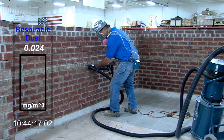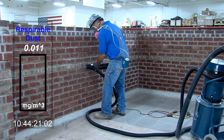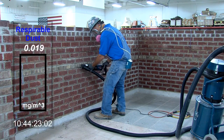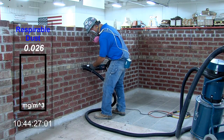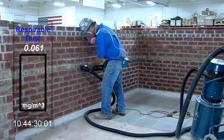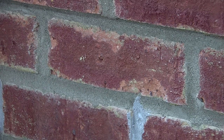Be warned, you can damage bricks if you fail to hold the hammer in a steady manner. Make sharp, straight edge cuts. Standard chisels and blades can leave half-moon cuts in the brick. Keep your hands steady and take frequent breaks. Make sure to gently score along your cut line — you don't want to damage the brick face.